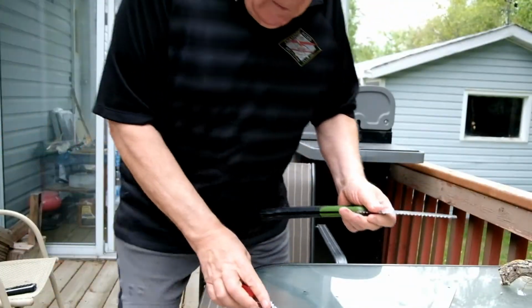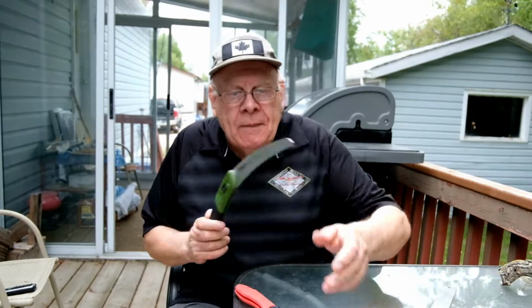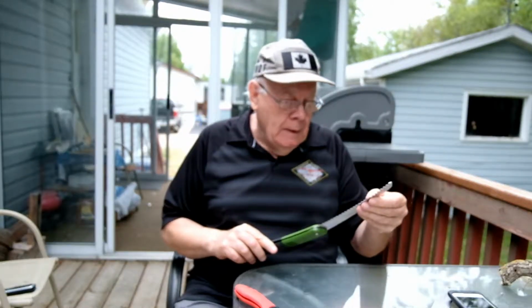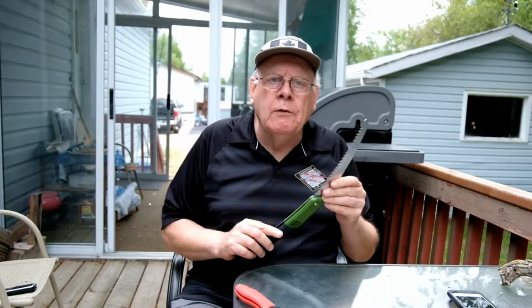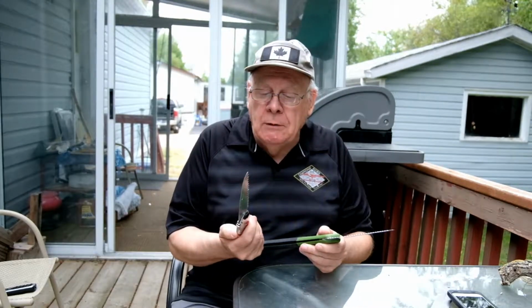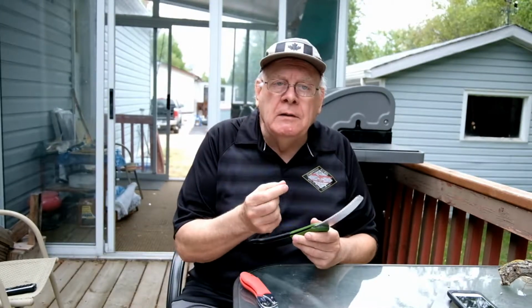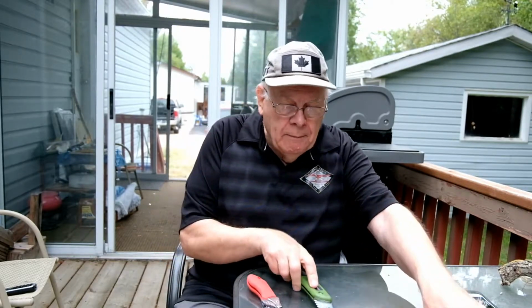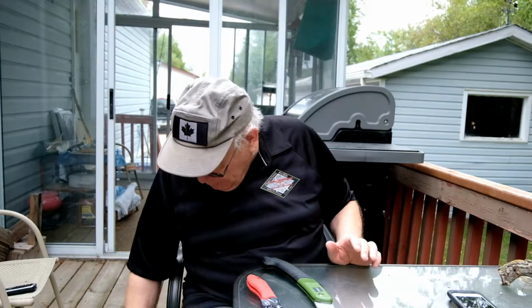They're both hollow ground. This one is less of a taper, I would say, to the grind. I had more friction in the kerf when I was cutting than I did with the Silky. The Silky is actually just a bit wider blade, and I'm talking about the teeth tips, because that's the only way we can really compare them. Now, what I was cutting, first off, we'll hit the last wood I cut, because that's the last piece. They're on top in my bucket.